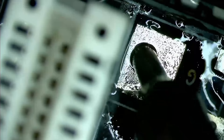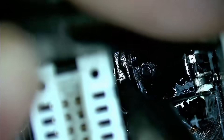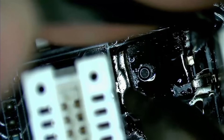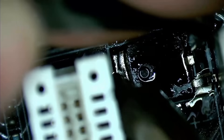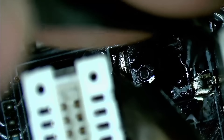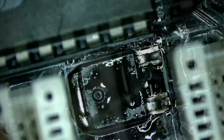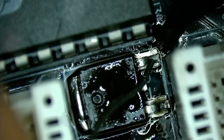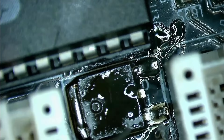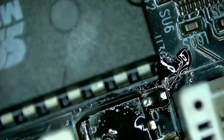The challenge will be to put this IC back on the board due to the limited space available. I plan to heat the pad and the tab of the IC with a soldering iron, and in the split second where the solder is liquid, move the IC to the right position. The large pad on the motherboard is most likely connected to a larger copper plane below the solder mask, which is quite good at diverting heat away from the IC. Timing is everything. But after only a few tries, I succeeded in putting the chip in a place where it is good enough for me. I am quite happy with the location of the chip and the fact that I didn't damage anything in that area with a soldering iron. Let's not forget the two terminals and we are done with this repair.